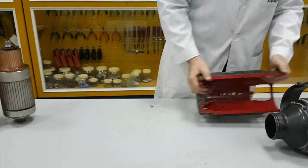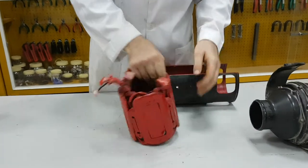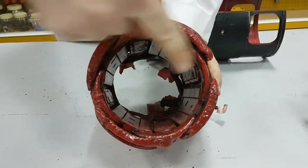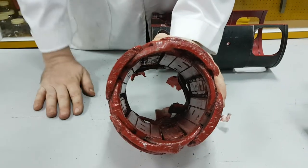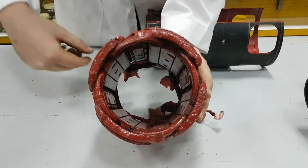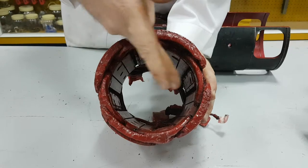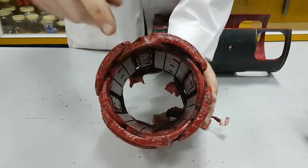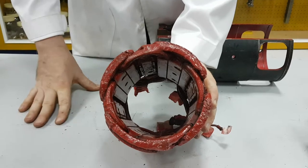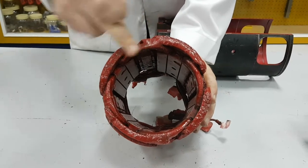So there's electromagnets and permanent magnets inside the generator. The next component is what we call our stator assembly, stator, or our field coils. Our field coils — basically in this case there's four of them. And inside of that we have interpoles, and we also have bits of metal that are making the magnetism stronger — iron generally. The wiring is running, you have two here at 180 degrees, and 90 degrees opposite you have two here. So we have 360 degrees, every 90 degrees we have a winding. Now these ones are creating a magnetic field. We've got current running through the coils, and that creates generally a north pole here and a south pole here.